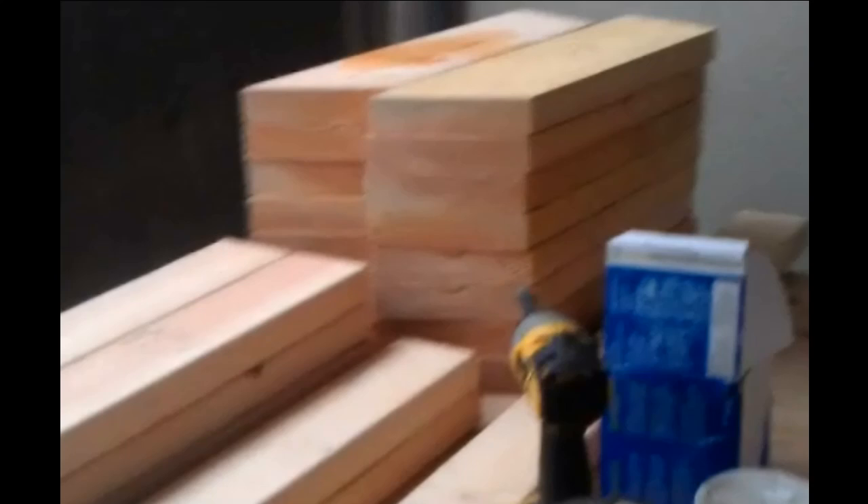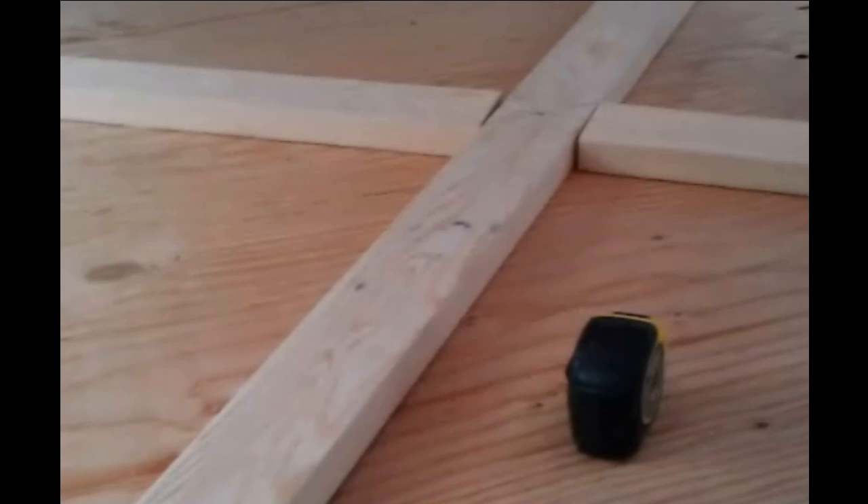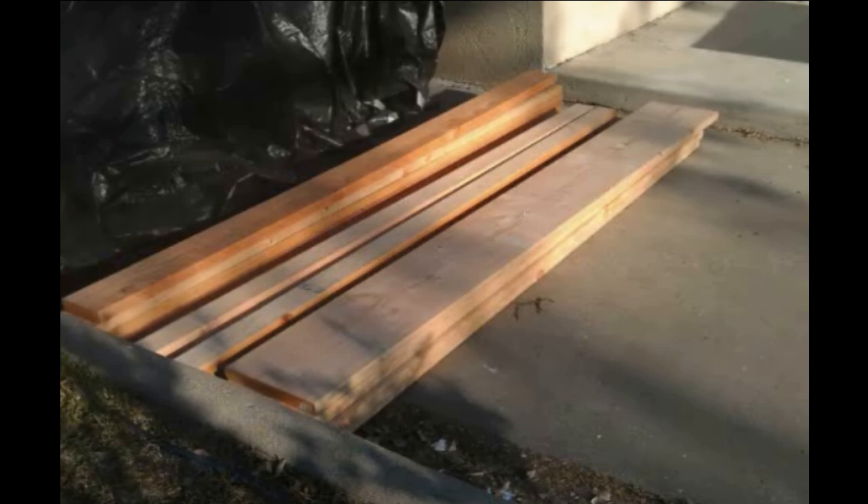It is raining today so the two of us stayed home. Gina went out to do some shopping and I stayed home and put up an easy-up. I found a really simple water wheel design on YouTube and I'm going with it, changing a couple things. Yesterday before it got dark I cut all my two-by-six at 22 and a half degree angles and some 45 degree points on the two-by-fours. I've got my biscuit joiner, nail gun, screw gun, glue, biscuits, and root beer, and I'm going to put this thing together — hopefully get both sides glued today.